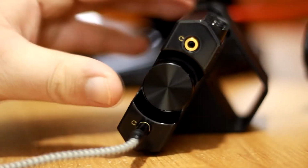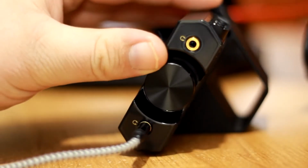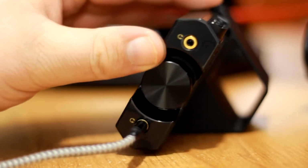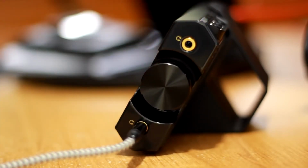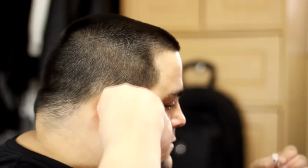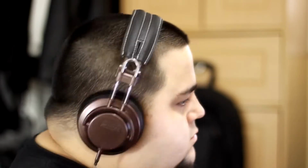I was happy to see the E5 really break out in terms of sheer amplification power. The spec sheet lists that it offers enough juice to power 600 ohm impedance headphones. It definitely lives up to this, as this bad boy can deliver some serious horsepower. I had no trouble at all powering any of my headphones that I tested, which ranged from generic Apple earbuds to mid-range 50 ohm headphones and a pair of higher-end 250 ohm headphones.